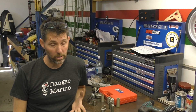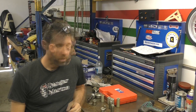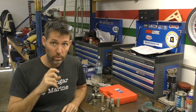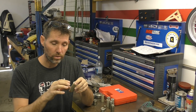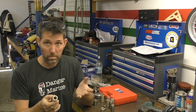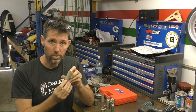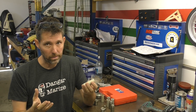This video has been a long time coming because I've been struggling to find the information and the tools I need — more than the parts. MarineEngine.com were able to supply the parts easy enough, but the tools were a totally different story. A big thanks to Craig from Hewitt's Marine down the road who lent me some of the tools I'm going to need. Unfortunately, they didn't have the spacers I need to set the bearings for the pinion to the correct depth, and it turns out they're actually discontinued, so you can't get them at all anyway. The information on the depth isn't available as far as I can see — it's certainly not in the service manual. It just says use this part number spacer to get the depth. You can't get it and it doesn't tell you the depth, so we're going to have to figure something else out.